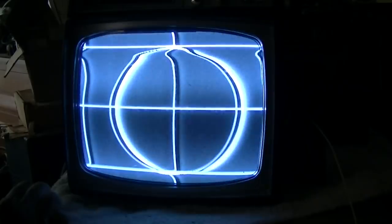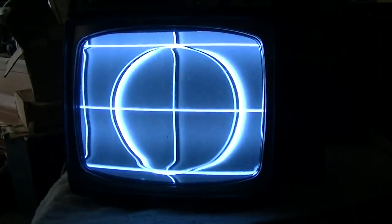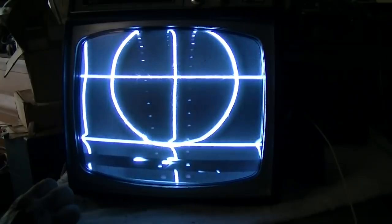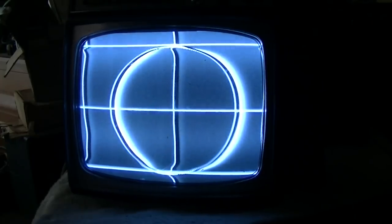Ooh, so that's if I... Yeah, the fine tuning is not working. That's just it, I can't fine tune it. On the pattern generator, if I bend the IF frequency, or if I shift it 4.5 kilohertz, look at that, it cleans right up. Yeah, there's a problem where the fine tuning doesn't work.